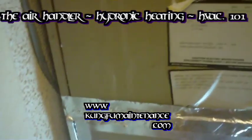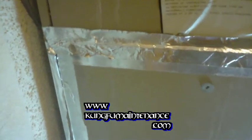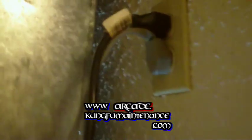This is a pretty typical air handler here. Usually on these air handlers there's a door switch right behind here, though often times they're not there. If you're going to service an AC unit, you want to turn the unit off. Even better, this air handler portion of the AC split system is plugged into a 110 outlet right here. So if you're going to service it, it's a good idea to unplug it. That way if someone else wants to turn it on, it's not going to turn on while you're working on it.